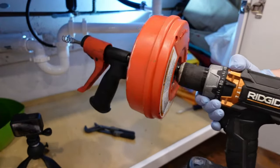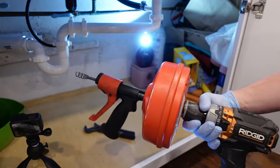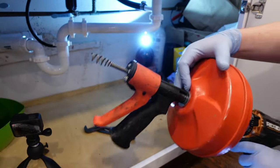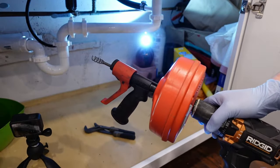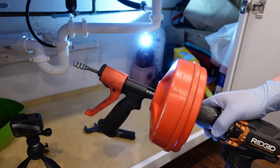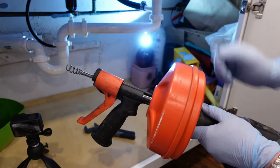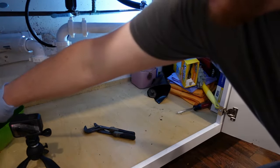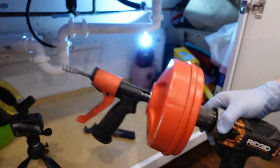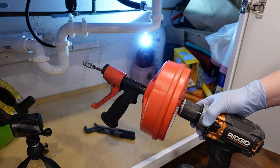All right, so what do we got here? Basically this thing works super well by using a power tool. A couple of things to mention — I probably shouldn't have been a beast and run it so fast. It says 500 RPM maximum. It still worked out, but as it bottomed out at the end of the pipe you could tell it started to curl up, and you can definitely cause damage to the wire if you do that. To give you perspective, I've been at it with a hand one for about an hour, and this thing just cleared everything up in at best five to ten minutes of usage.